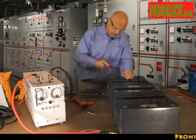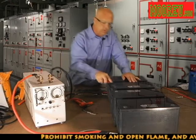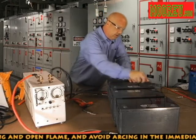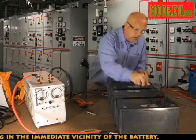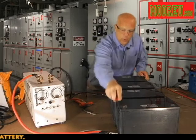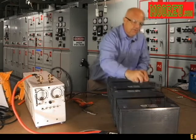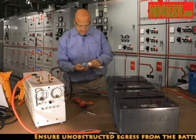Brush the connections. Usually the manufacturers will provide you a plater's brush. Make sure you get all the dirt and debris off them. If there's any type of copper oxidation — that blue stuff or that white stuff — you want to get all that off. Get some no-ox, put a little no-ox on those connections.